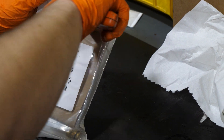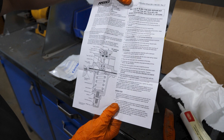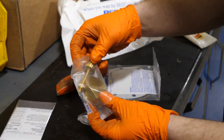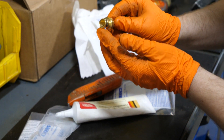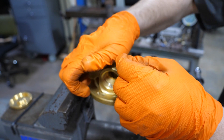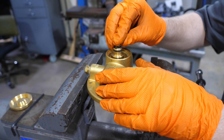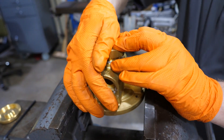To reassemble your regulator, you will first need to get a rebuild kit like the one shown here. Note that there is a cutaway diagram showing how all the parts go together and full instructions on how to rebuild the valve within the kit. We will follow these instructions in this video. Also note which parts will be used again and which ones will be replaced. Always use the new parts if supplied in the kit. Lubricate the O-ring of the new seat disc assembly with a lubricant suitable for the gas the regulator is used on. Install the new seat disc assembly with the new small spring. Nest the spring in the socket of the seat disc assembly. Place the new Teflon seal in the counter-bore of the body. Install the new back cap in the body using approximately 30 foot-pounds of torque.